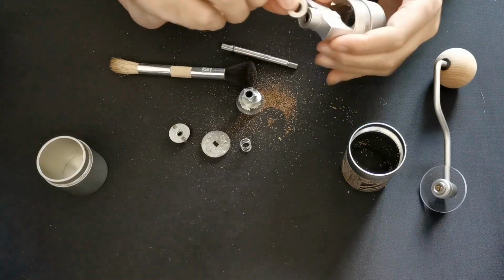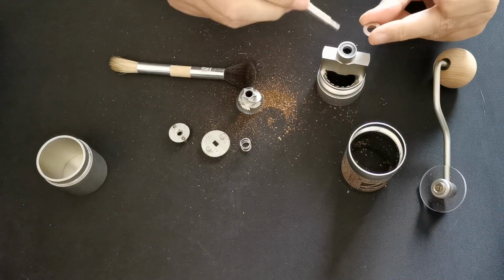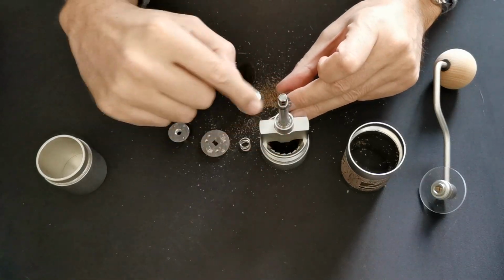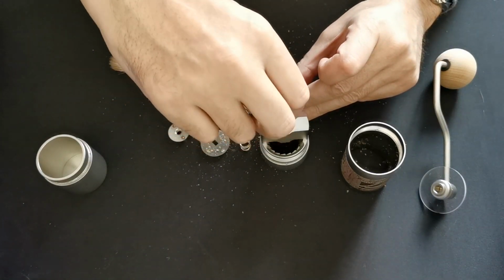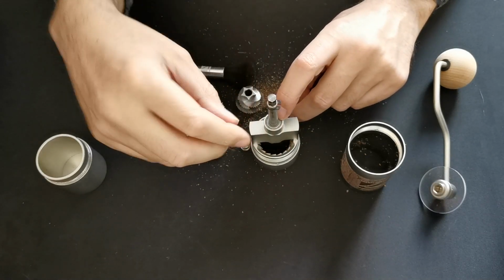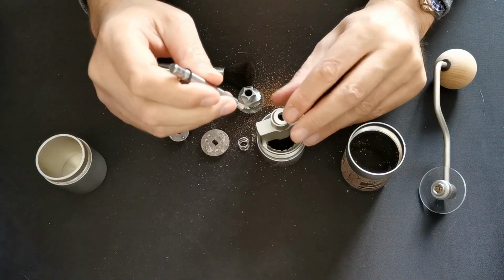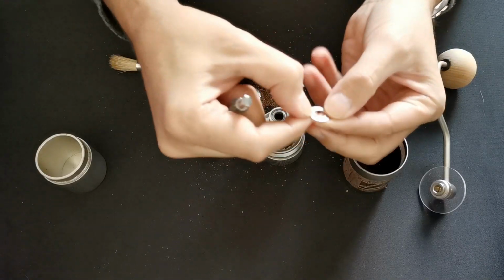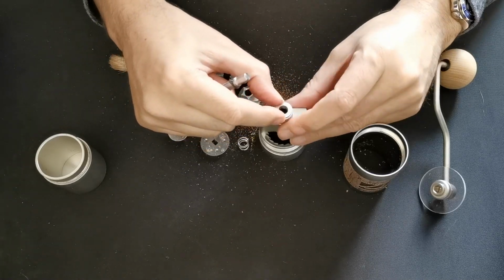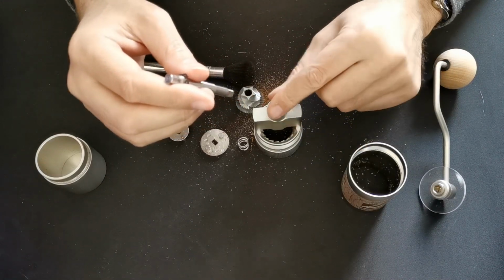and this is like a bearing cover on the top. Now, bear in mind that although you heard it squeak slightly, that's because this shaft is meant to be a tight fit in that center, because the actual bearing itself is what rotates. This shaft should stick in the center of the bearing as it does. So that's the cap that you mustn't forget to put on top of the bearing. And you can see there's a little rim there. That goes rim downwards onto the bearing, not rim upwards, which would be the wrong way to have this fitted.